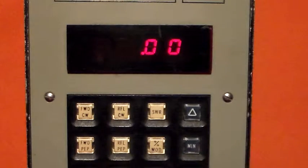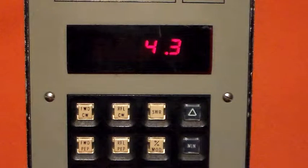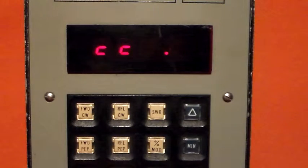Reflected peak envelope power — I'd expect that to be zero, and yes it is. Percentage of modulation: that's a difficult one with SSB because there's no carrier, but it's seeing some numbers and they're jumping around — that's probably OK.